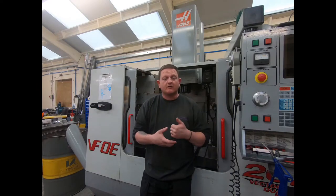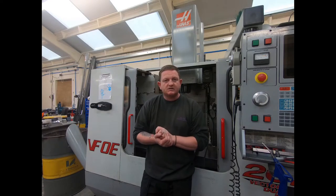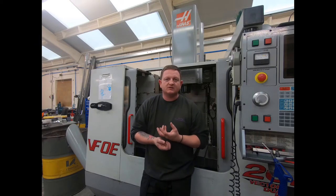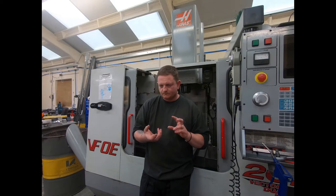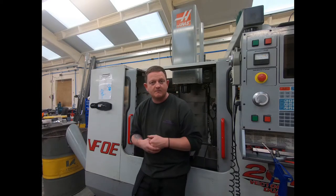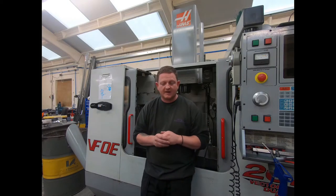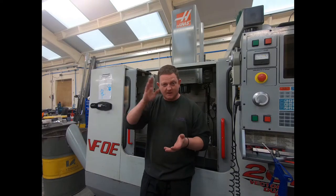The machine's currently good and working. It's just turned off at the minute. The issue was, when I was running the machine in various spindle RPM, it almost sounded like the bearings were starting to wear on the machine. It was fluctuating in RPM, which normally people say it should be literally one RPM up or down and that's it. They're normally very accurate with how they sit. Mine was going sort of anywhere 10, 15 RPM bouncing.